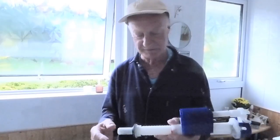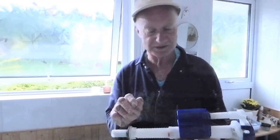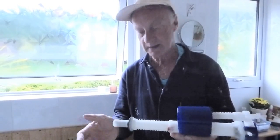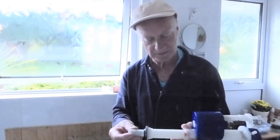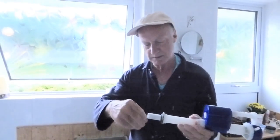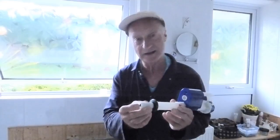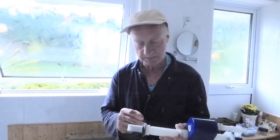I'm just going to put this valve back because nothing's actually wrong with it, but yours has gone so you're putting a new one back. There are several types you can buy — I'll put a couple of links on for the ones I like, probably a Fluidmaster, but also the Torbeck valves which are supposed to be slightly better quality. One thing: if it's going on the mains, leave the restrictor filter in there. If it's going on a tank-fed system, get the pliers on and pull it out — it runs better with more flow without that filter on a tank-fed system.